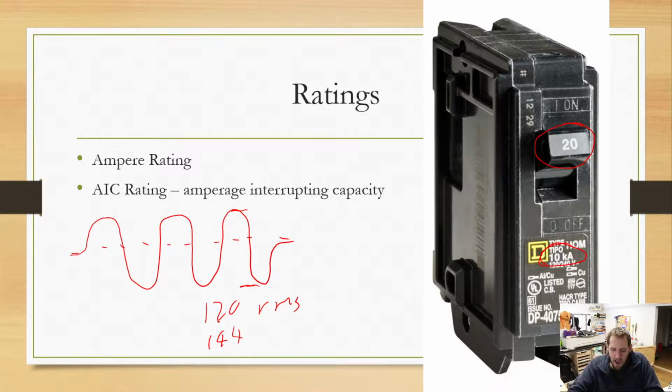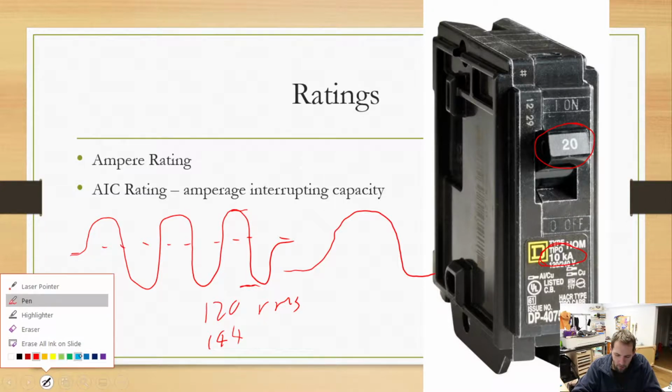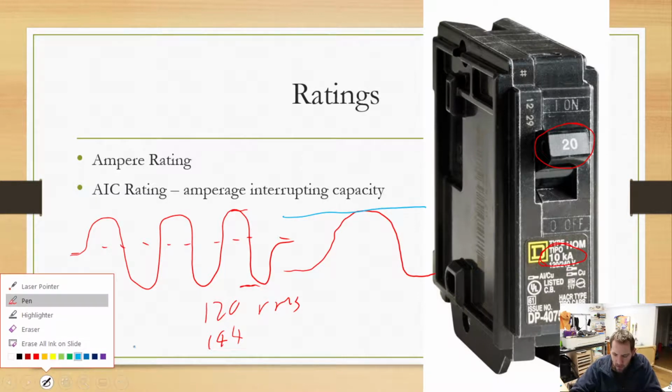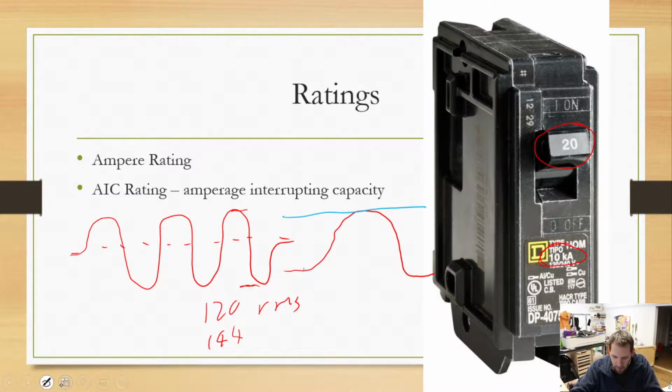So to qualify this more for the equivalency, if we really look at that arc, that's what an AC arc would look like. And DC would just be this perfectly straight line. Now, when this leaves 0 right there, and when it hits 0 again right here, you'll notice that DC actually wouldn't be there. DC would be lower, more down here.